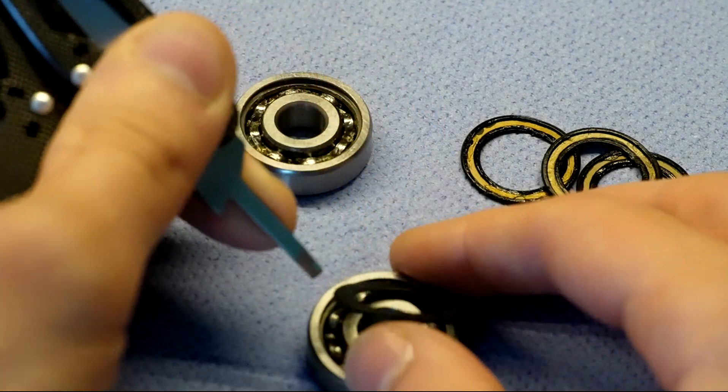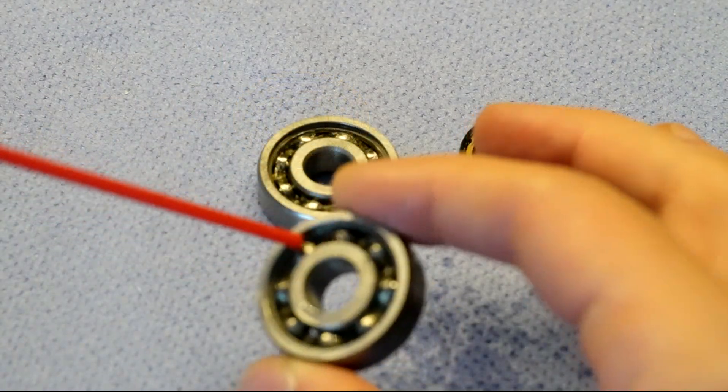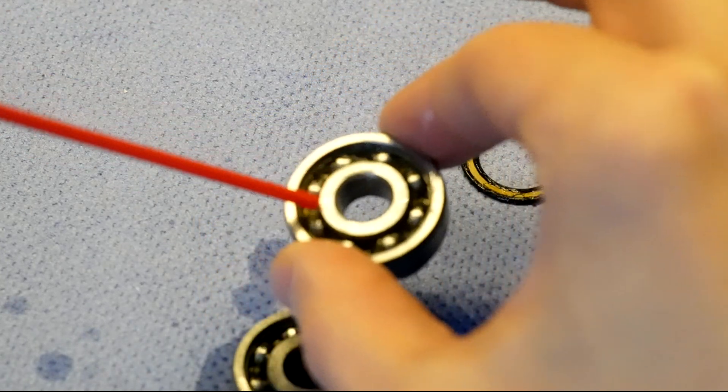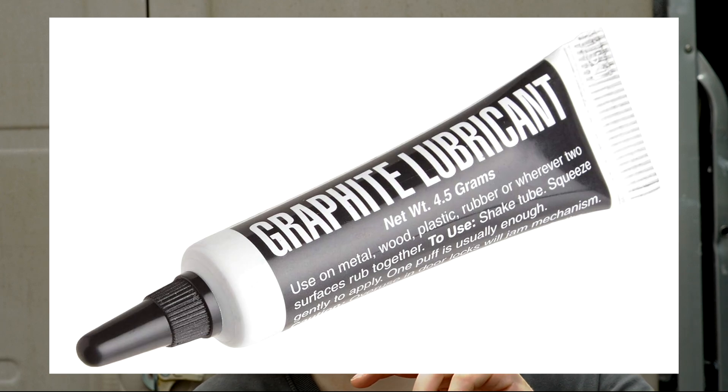This time I fiddled with the bearings a little. I took off the plastic caps and sprayed some PTFE lubricant into the bearings, which made them spin a lot easier and more able to retain their rotational speed. PTFE is what I had available but it is nowhere near the greenest solution — it's actually a forever chemical, a perfluorinated compound that lingers in the environment for a long time and is a pollutant. A much greener solution would be to use a thin layer of graphite spread among the inner parts of the bearing, which should also provide a reduction in friction, perhaps not to the degree of PTFE but it's at least something.